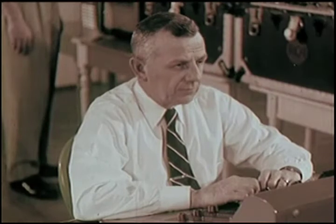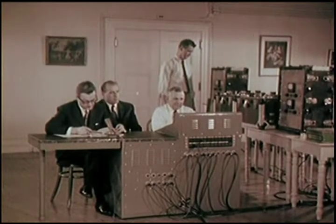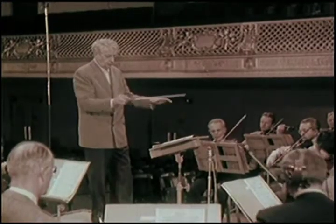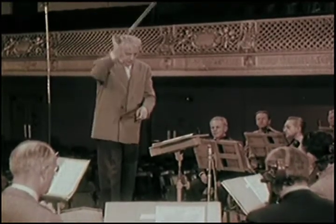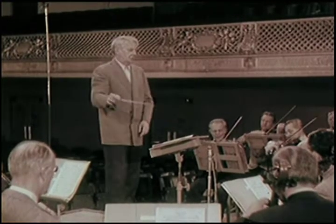Well, the recording music director, or any one of the sound engineers, could easily explain it all in 10 weeks. But let's just take a look at three of the fundamental requirements of high-fidelity recording. The first is full dynamic range. That's the spread between the softest and loudest passages in the music. In a concert performance, the range is as wide as the conductor feels the score indicates.